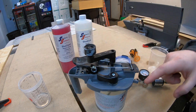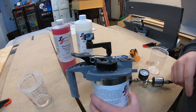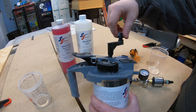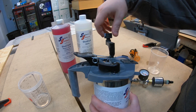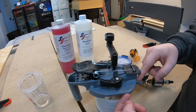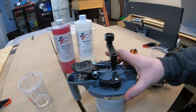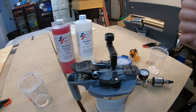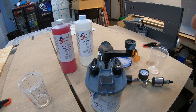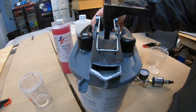I'll talk real quick about this lid — I'll throw the link in the description. It comes from Rockler Woodworking and is available in quart and gallon sizes. The crank on top is attached to an auger inside the paint or primer can, allowing you to stir all the way to the bottom very easily. It also has locks that hold the lid tight with a rubber seal underneath. The nice thing is you pop the lid off the can one time, leave this on, and you never have to worry about removing it again. I've had this on for about six months since the last time I primed. It also has a handy pour spout for easy pouring into your bucket.